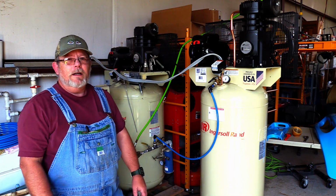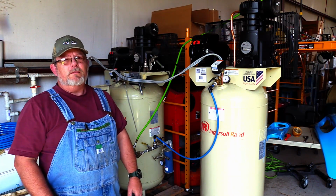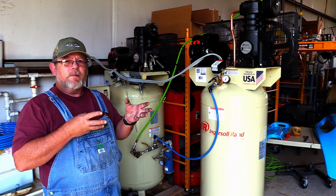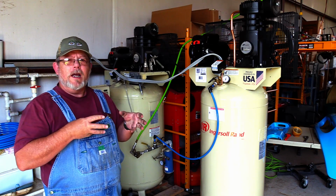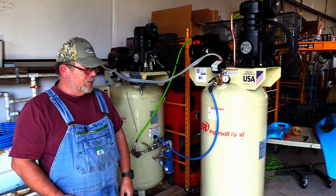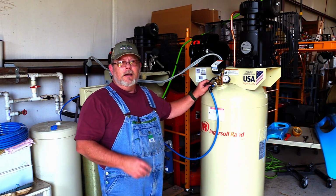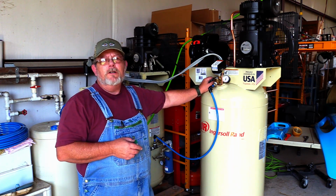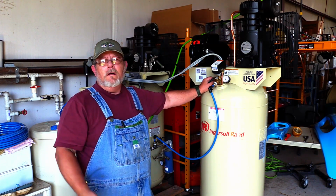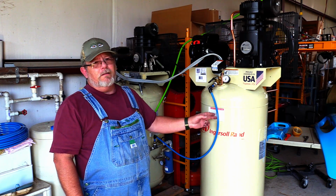Long story short, he did some research and figured out that the worst thing he possibly could have used was PVC pipe, because the air compressor will dry out the PVC, and when you dry it out, it weakens it, and of course when it weakens, it's liable to burst like his did. So he ended up going with a system very similar to this and did his entire garage in 3/4 inch tubing. This was 15 years ago, and he hasn't had a problem with it since. So I know for a fact this stuff will last for a long time.